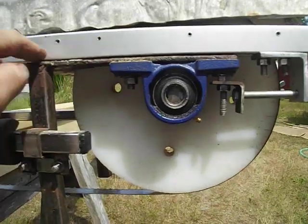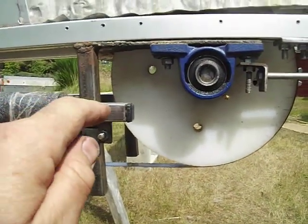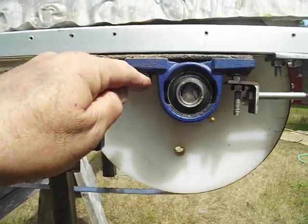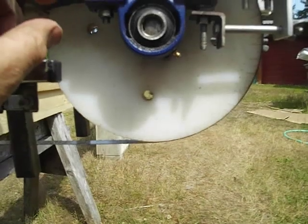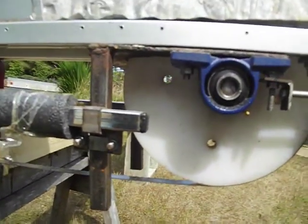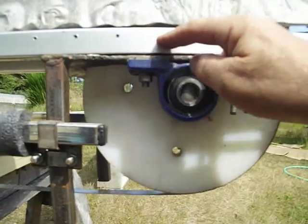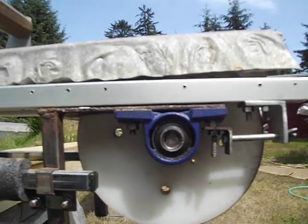For this plate to slide back and forth to tension and align the band, there are only two nuts that go through into the backbone at the front end of the pillow block bearing. They're set up with washers so that they're not gripping — they can slide up and down in the slot. Even so, it doesn't slide as well as it might.